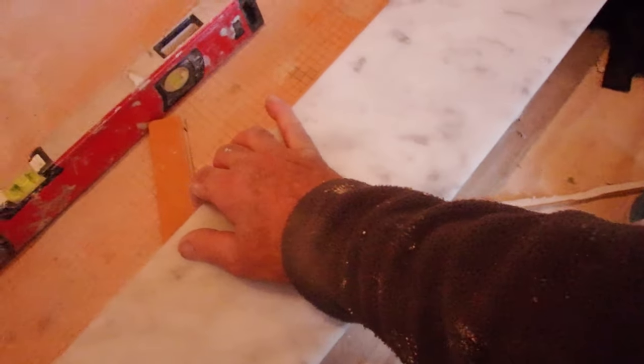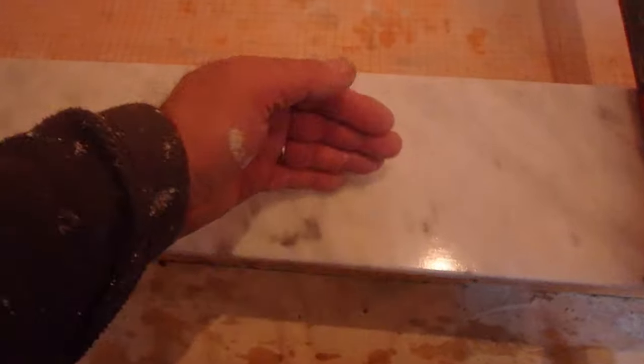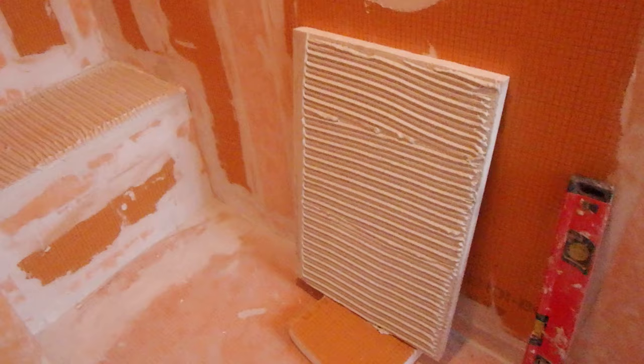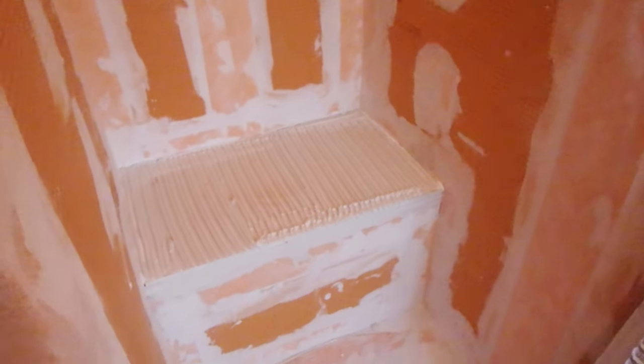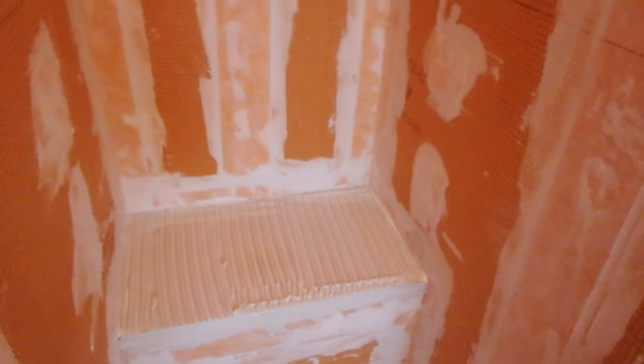So it won't move now. It's level that way, and tilts in towards the shower so the water runs off towards the shower. You don't want to make it too steep, because the door is going to be here — if it's too tilted, the door will hit the edge of the threshold. So you want it pitched, but not too steep. I've got it set on both surfaces, placed it and checked that it's level side-to-side and tilted the right way.